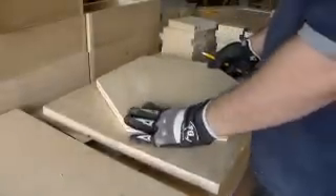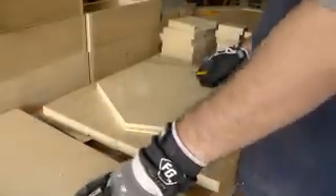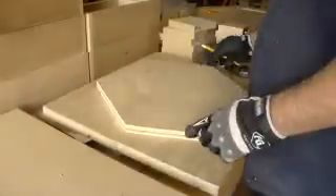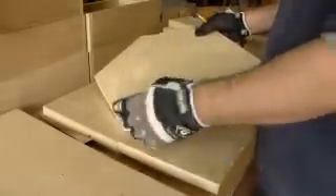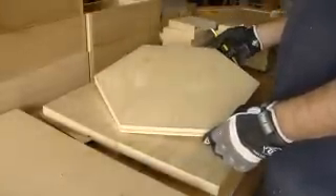I've got my shelf cut and I'm using plywood for this because I want it to be stable inside. I don't want it to expand and contract and possibly mess up the pedestal later in the life of the piece. So this is plywood for the shelf, cut to size — a quarter inch oversize from the mark, to fit in the dados.